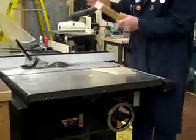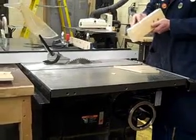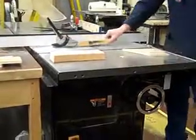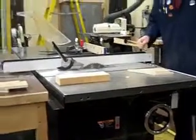So that's ripping with the grain. Now there's a possibility when you cut this that the knot is loose and it can fly out, so be aware of that. When I'm ripping, if the piece of wood had kicked back, it would have missed me because I'm to one side or the other — I'm never straight on into the cut line.